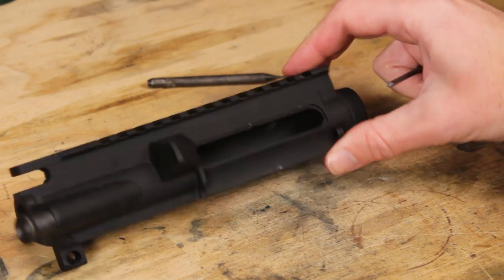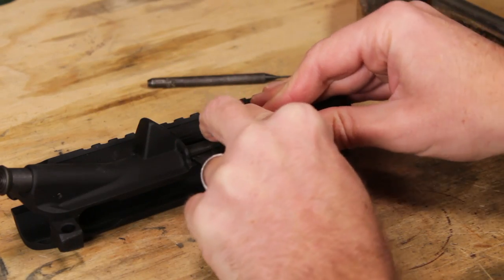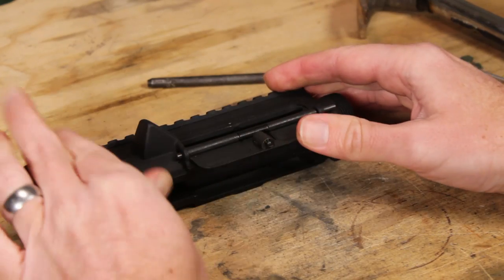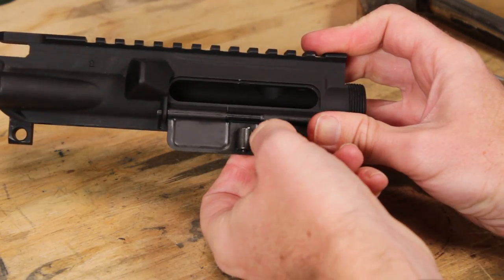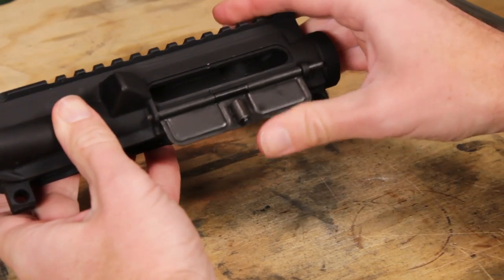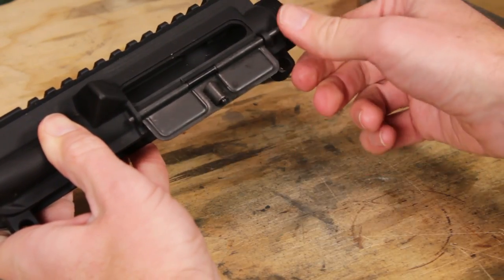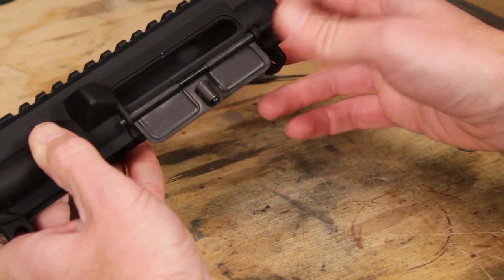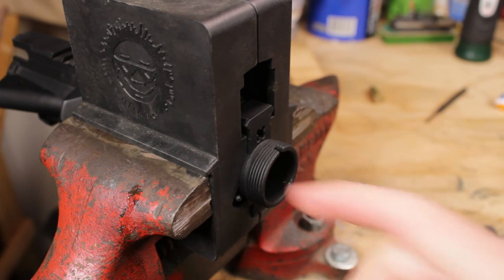And here's the last juggling act, the door. There it is. You can see I put the long end right there, short end up here so it doesn't actually stick out into the port right here. Yeah, that should pop open nicely. Now this right here is going to be retained by the barrel nut. It's loose right now, so don't accidentally knock it out and throw your springs everywhere, but this is gonna go on next. Now the work gets easier but more critical.